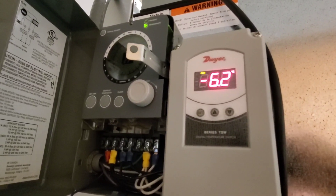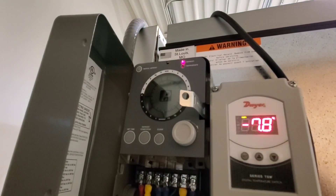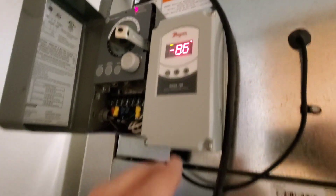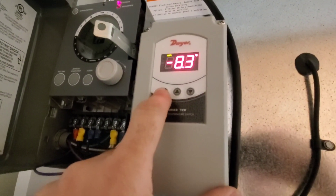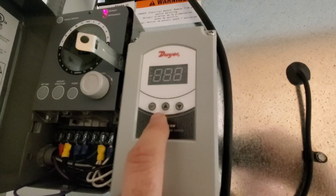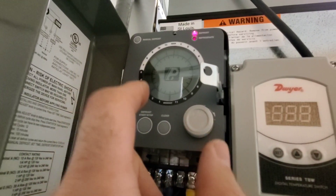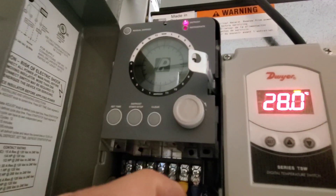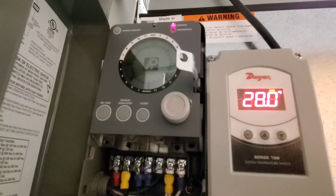It's come out of defrost already and there's still quite a bit of ice buildup, especially on that suction line coming back to the compressor. So I'm going to put it in another manual defrost. This is for the defrost cutout — it's got two cutout set points: 13 degrees Celsius and 28 degrees Celsius. We might have to play with these numbers and look at the defrost times on this clock. In the past I believe I set six defrost times instead of four to avoid this problem.